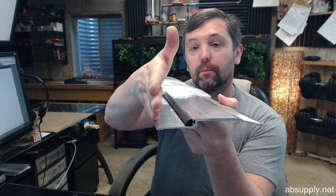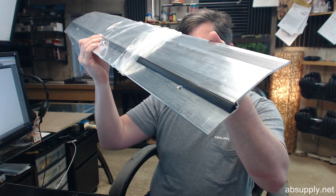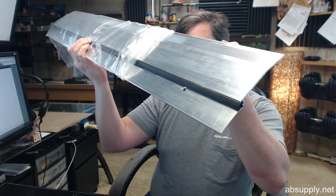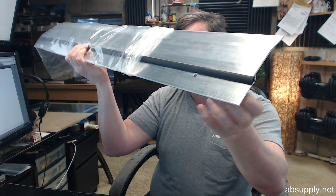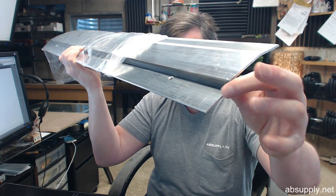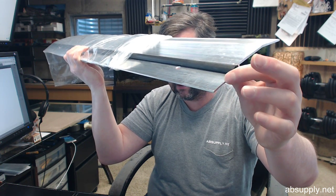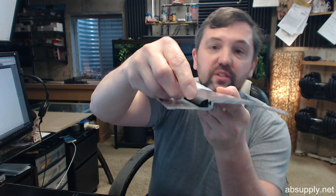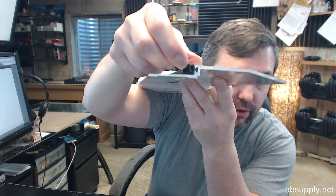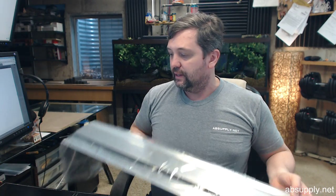Okay, door makes positive contact with the inserted seal that's here. That's an extruded bulb finger piece of neoprene, which is smoke and draft control related as well. That double sort of seal, this finger they call it here, as you can see, helps compensate for any sort of lateral misalignment in the jamb.